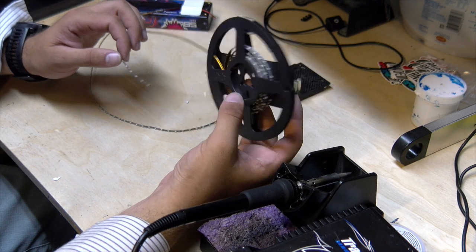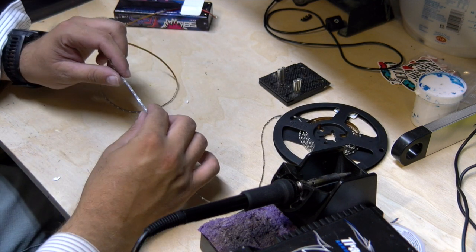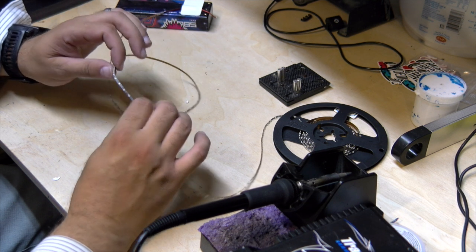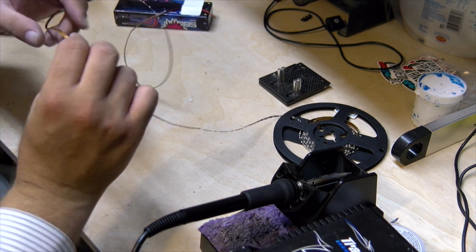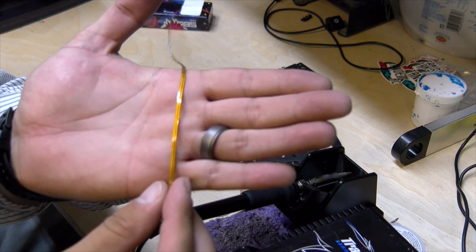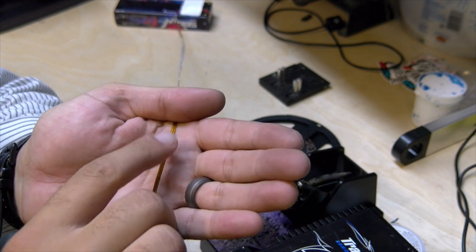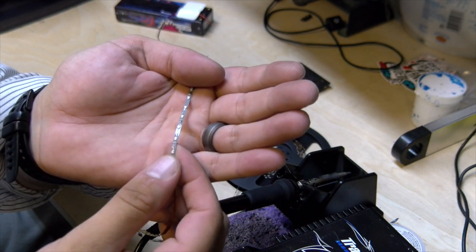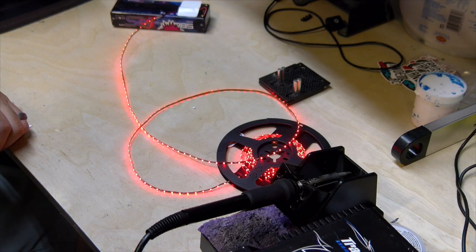If I remember correctly, there's like 5 meters on here — plenty of lights to go around. You could stack these to make some pretty cool taillights, make some underglow, they weigh next to nothing. You can cut them wherever down the line that you want and solder them together. They have these little exposed back protrusions — about every inch there's an exposed piece of copper that you can hit with the solder. I believe you just take a little bit back on the gray.